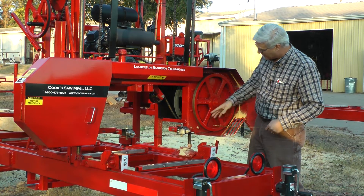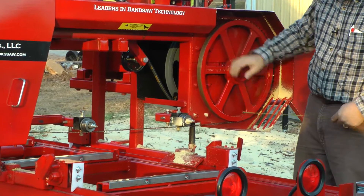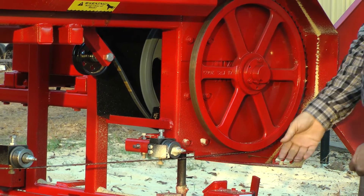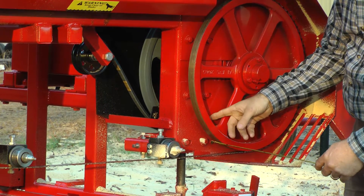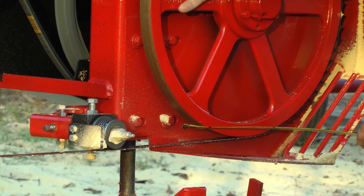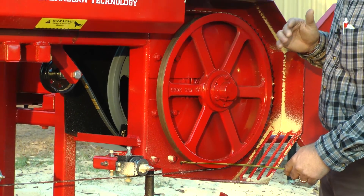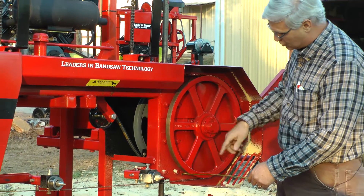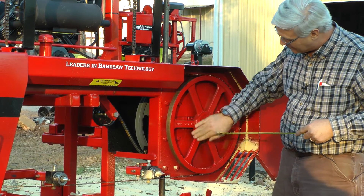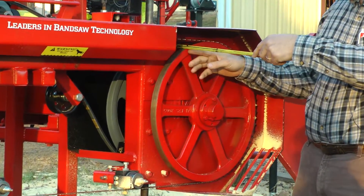I like to get off of this three by six tubing where we're bolted in — you can see the bolts here — and I know that's good and flush. This guard could be tilted back a little bit, so I don't go dead to the middle of the guard. I get as close as I can to the frame and as close to the center of the wheel, knowing that I'm referencing this three by six tubing. I measure at the bottom and then at the top in about the same place, getting pretty near the peak of that wheel.